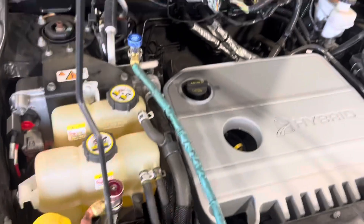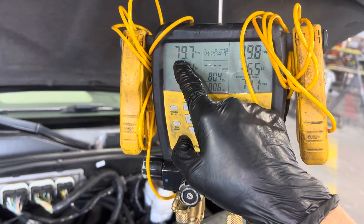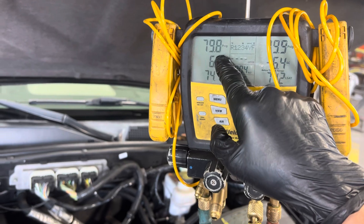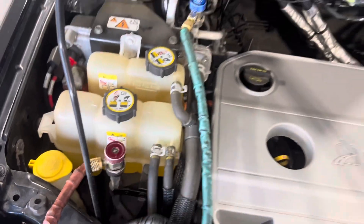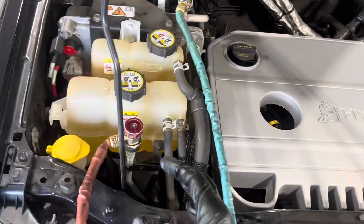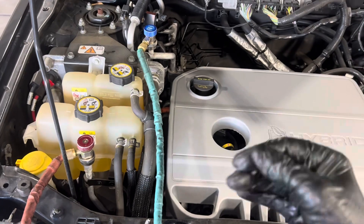I connected the gauge line right here and I think this might not have liquid in it — it's about 80 degrees down here and the pressure seems a little low to me. But what I noticed when I had a little refrigerant leak out was I put my nose down here and smelled it, and it smelled kind of foul — like a dirty fish tank. That usually means the system has a lot of moisture in it.